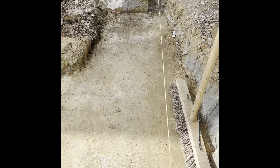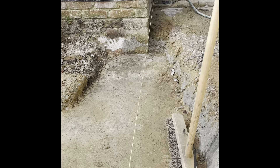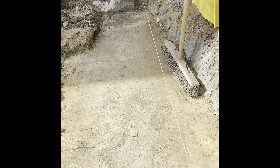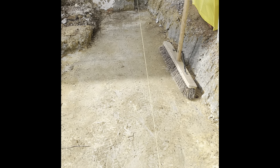For setting out purposes, I've done a string line with my normal lining pins pinned into the brickwork along the house. I've come out along the footing and you basically hold the string line nice and tight, coming in just until you're touching that brickwork, then level down. That line there is my external face work.